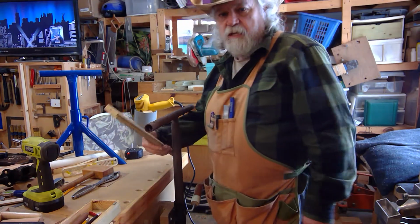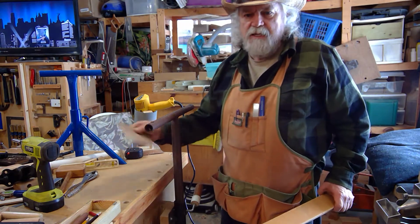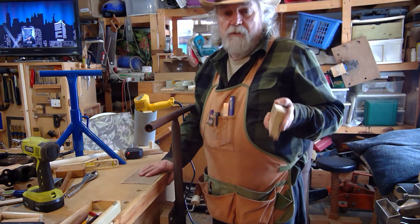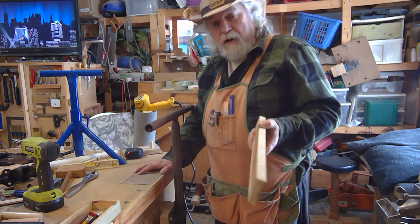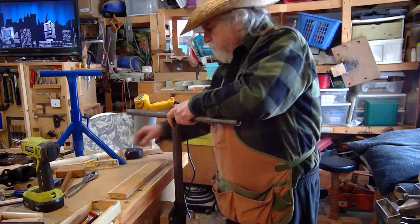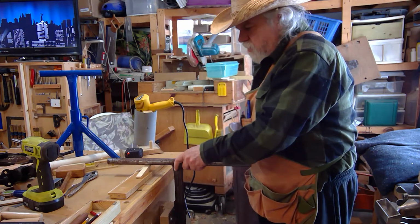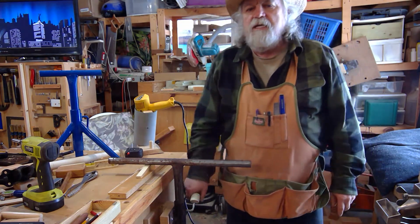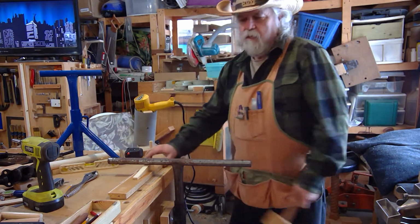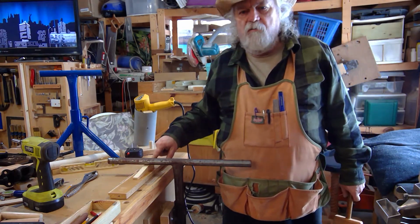Well, let's take a piece of wood like this. I'm going to take a piece of double-sided sandpaper. I use that for holding power. If you want to know what I'm talking about there, you've got to go look at my video called holding power from last year. And I'll put that there to hold it down and take my wedge and set it there, drop that down on there, and then just tighten this down. Then I can take my hammer and give that a couple of whacks. Guess what? I'm now using this like a hold fast.